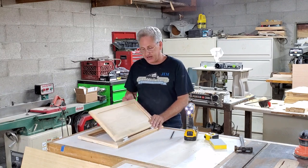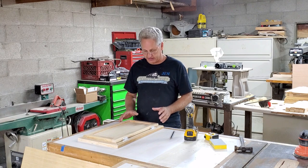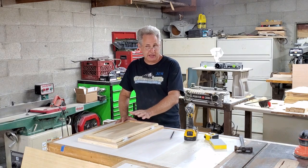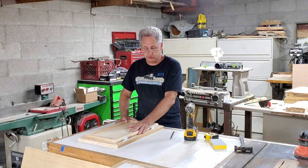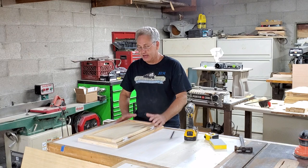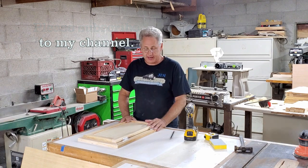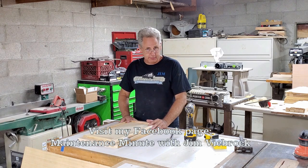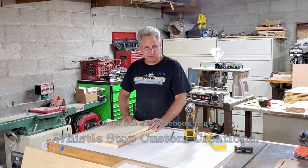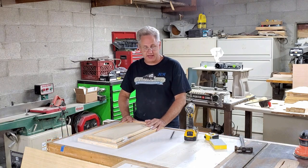Let me give you a little tip about painting. This was pine — if you build yours out of something else you probably won't have this problem. Pine is notorious for knot bleed. I cut my stock around the knots to avoid it, but if you've got a knot and you go to paint this white, that knot is going to bleed through. My suggestion is to use a colored primer — there's something about the pigment in color that will stop the knot bleed, and then you can paint it white if you want. If you like these videos, please subscribe to my channel and tell a friend. My Facebook page link is in the comments, as is my wife's Facebook page — she has custom creations. We'd love your feedback, so feel free to comment on this video and our Facebook pages. Like and subscribe — I appreciate you watching today. Have fun and woodwork often.